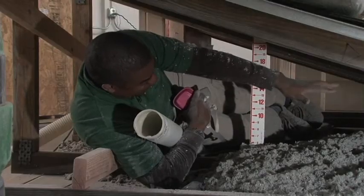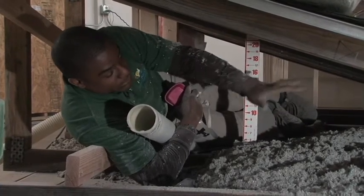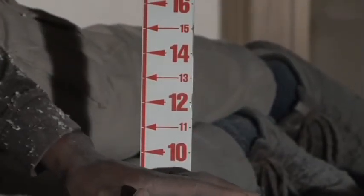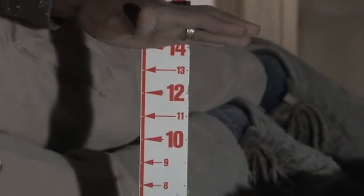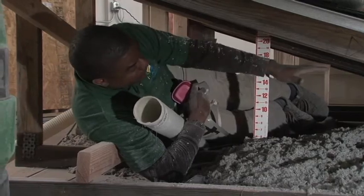So we're at about six inches right here. What the technician would do if it calls for 14 inches — go to about seven and a half inches in an area, make sure it's nice and flat, then go up to the finished 14 inches, then move to the next spot in the attic and do the same thing.